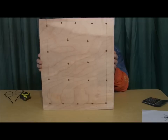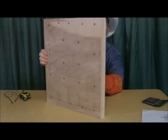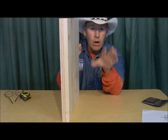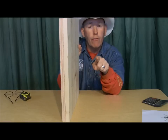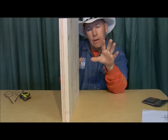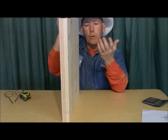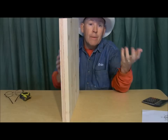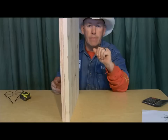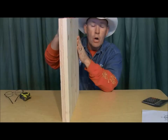Okay. So, right now, this is 1 1/2 inch board, but it's 3/4 inch pine, that panel board, like on video 45. Now on video 45, I talked about using 1/2 inch backer. I've kind of adjusted that a little bit. I want to go at least 5/8. This particular one happened to be 3/4 because they didn't have any 5/8. So I'd rather go heavier than go lighter. So this is 3/4 inch backer on that.